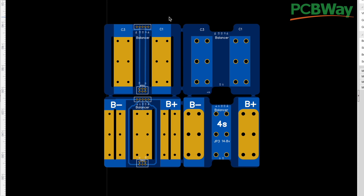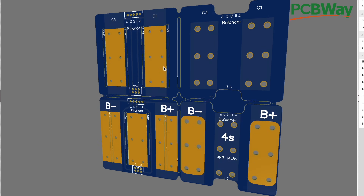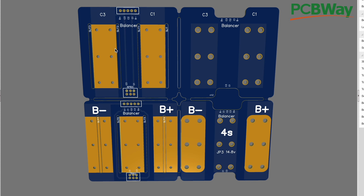The design is pretty simple. It's just a flat plate that is going to have slits for the cell tabs to poke through. It's just a board with slits right here, and it has exposed copper to help conduct electrons from one cell tab to the next. The holes here are to guide self-tapping screws. There are four boards in this design, and what you want to do is sandwich the two tabs together — you put a board in the back and a board on top, then use a screw to squeeze both boards together. The holes on the bottom board are a little smaller than the holes on the top board so that the screw only grabs the bottom board and uses the top board just to squeeze.